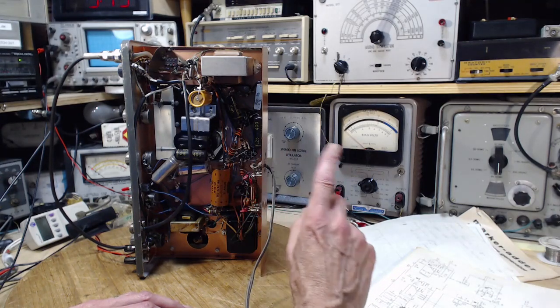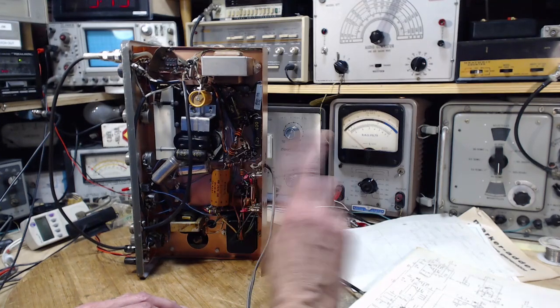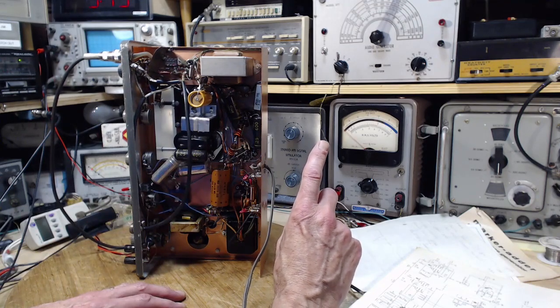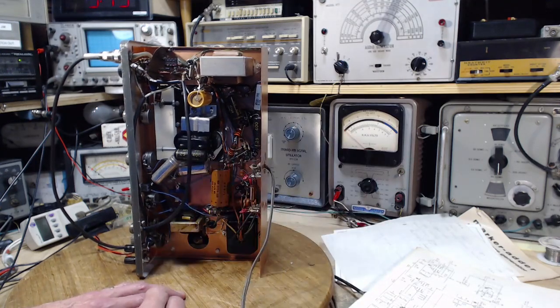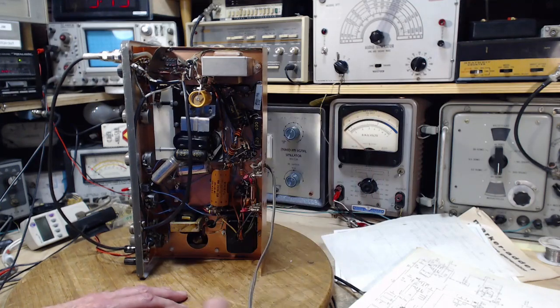But if you chart it for 24 hours, which is what I used to do, you could see quite clearly it's active during the day, and then at night it settles down to a quiescent point, which is extremely interesting, but I won't talk about it. And then the current begins again the next day. What's happening? The streetcars are running, the subway's running. What does a transformer sound like with this kind of DC current flowing through the windings? It is screamingly loud.